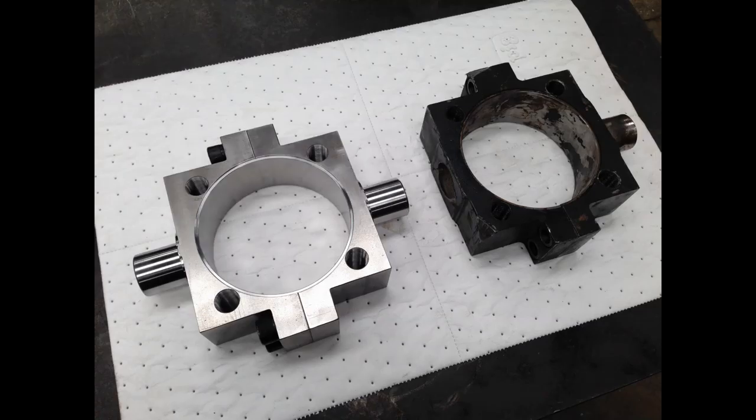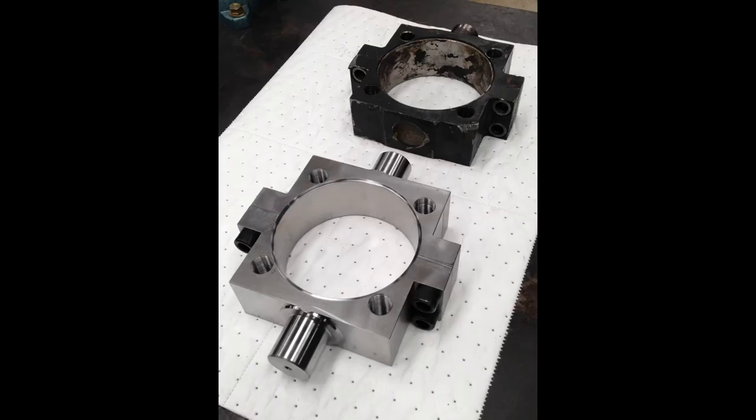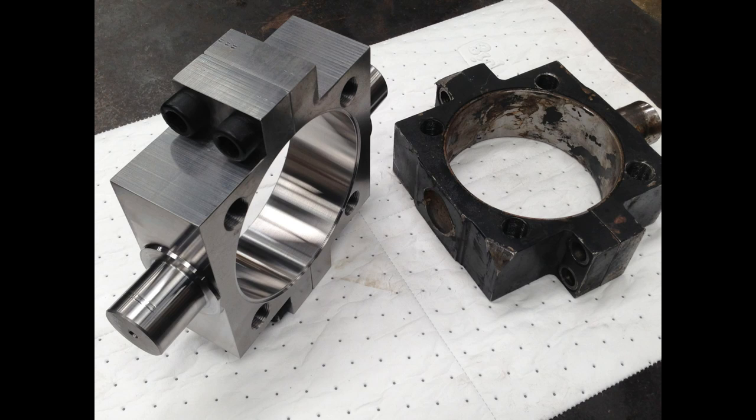And we've got some shots here. There's the old piece next to the new one that I made. You can see why I had to build one. One of the trunnions actually broke off. That's a common problem with these trunnions, that they'll break one of them off there. So that's about it, man. That's building a trunnion. So just some more detailed finish up shots here.